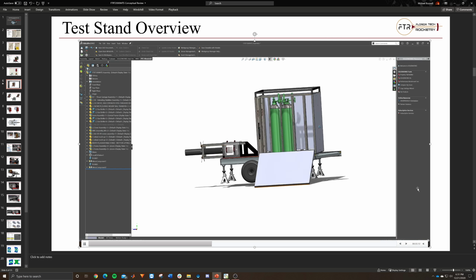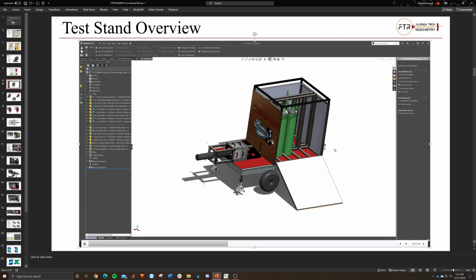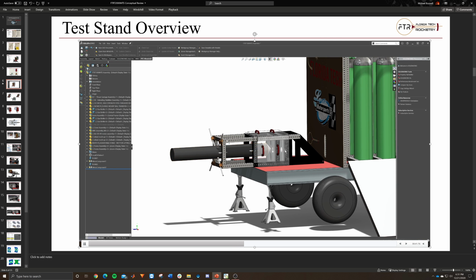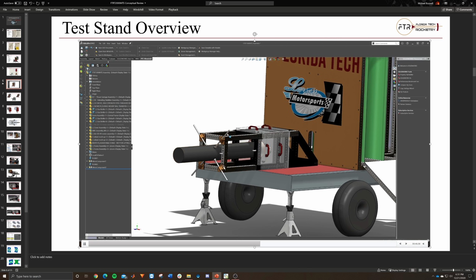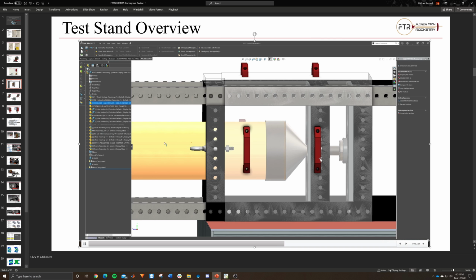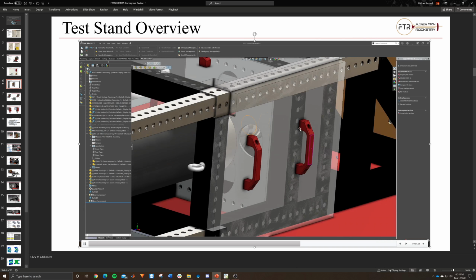That was a quick zoom on the thrust structure, but this is showing you how the tanks and the frame are. The piping would go inside there, come out right around here, and go right into the motor. So this is the thrust structure. This is what I mean by having an extending stabilizing ring. Essentially this will move forward and contract backwards and pinch in and pinch out to account for various motors. And then it has a linear guide that goes into a load cell.